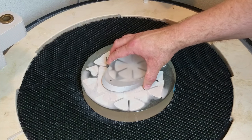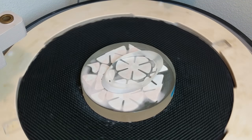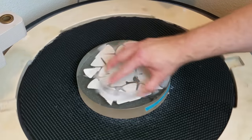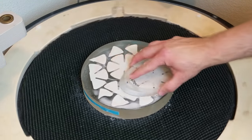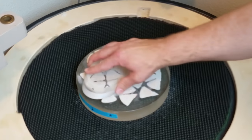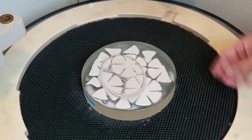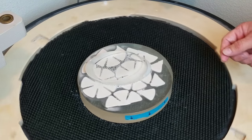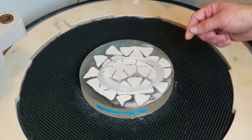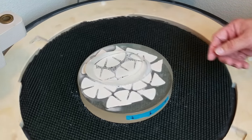The back of this mirror goes on the pad surface. I'll turn on the machine at fairly low speed to start, just to make sure we have no problems with the polishing pads, then polish in every direction to get the back clear. You can see that as soon as the mirror goes wet it appears clear — so it's a little misleading. You have to stop, rinse it off, dry it, and take a look to judge the actual quality.